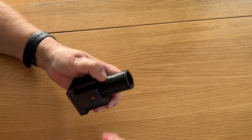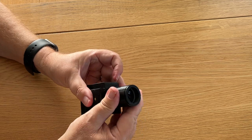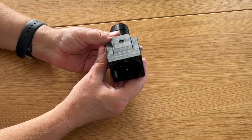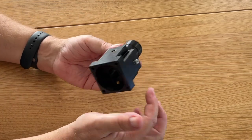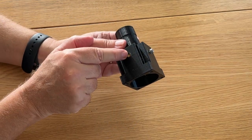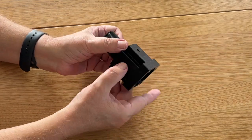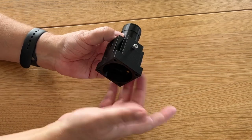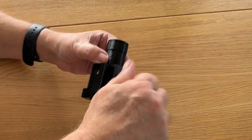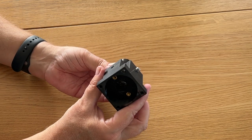The next operation consists in mounting the collimator tube in the telescope interface cube. The tube must slide without forcing. You then mount two M4 screws in the inserts provided on the interface cube. Note that one of the inserts is not used — it is located in the extension of the two inserts used to fix the slit. There is a side where there are no inserts; respect this arrangement. You only tighten the screws by hand to keep the tube in place — do not tighten the screws firmly at this time.